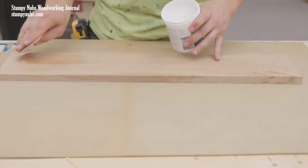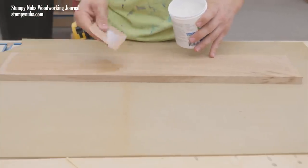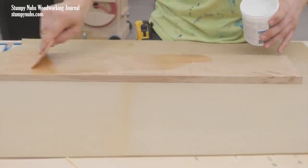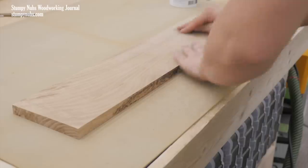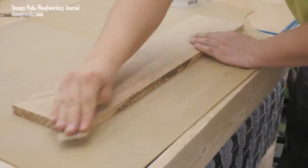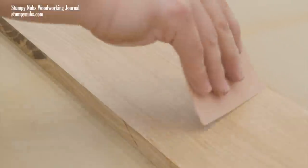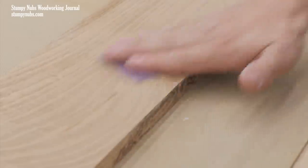The filler is a light paste. I like to apply it with the same type of plastic spreader that you might use for body filler — an old credit card would work too. Try to press it into the pores as you cover the whole surface, then clean off the excess. Let it sit for a half hour or so. Before recoating, lightly sand by hand with 320 grit just to smooth it out a bit, then put on some more. You'll want at least three coats, but these go very quickly because it spreads easily and it dries fast.